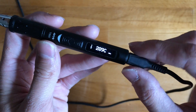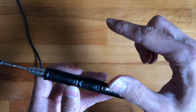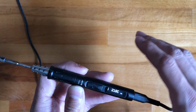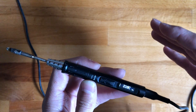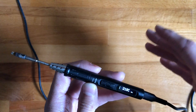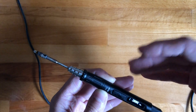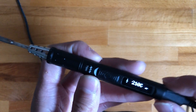Let me simulate how this would happen. Basically what Quick Charge does is it constantly tells the charger 'give me 12 volts.' The moment this connection breaks, this communication channel — which occurs over the data lines — stops. The charger then drops down to 5 volts to avoid damaging any non-Quick-Charge-friendly device.